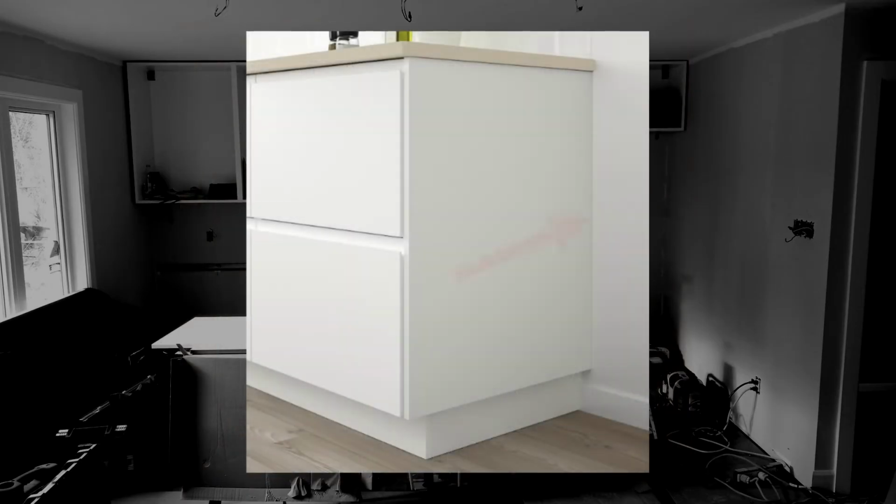In this picture, you will see where I have put the arrow that the panel is sitting really nice and tight to the wall, but the problem is that quite often the wall is not plumb, and that means if the panel is just added to the cabinet, it will either be sticking out too much at the front or there will be a gap at the back. And of course, we would like to avoid this. The problem is relatively easy to fix if the panel is sticking out, because then you can just trim the back of the panel to follow the wall, and that's not too difficult.